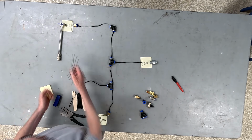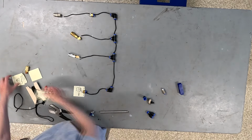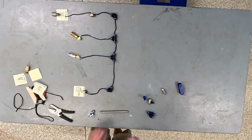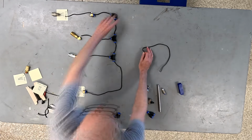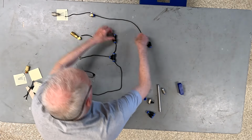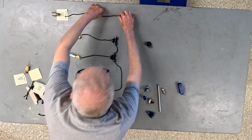One thing I kept in mind was to use the flexibility of the 1/2-inch pipe to my advantage by limiting the number of fittings. Making corners and turns with this pipe is easy. That way I did not have to use fittings for the turns, and less fittings equals less chance of leak points.